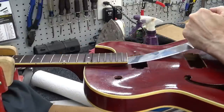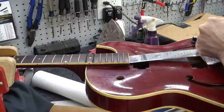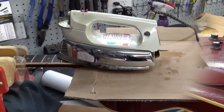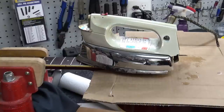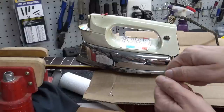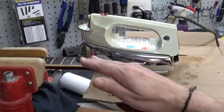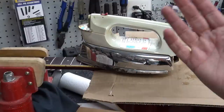I had that iron right here for about 15 minutes, but I think right now we're starting to make some progress. The left side of my brain is saying okay, you're halfway there, just put a little more muscle into it. But the right side of my brain is saying wait — heat it up some more, let this knife find its way all the way through with a very light touch, because when you start forcing it, it's going to dive down into the wood fibers. I want to keep it right on that glue line — it's just an eyelash-thick glue line, but it is strong. I'll let this sit for another eight minutes or so.